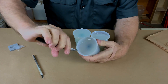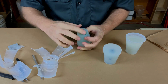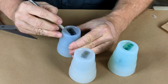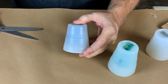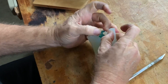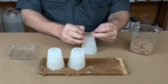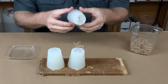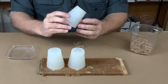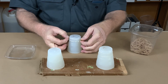Let's do some cup shucking so we can get to cutting. If I have one criticism of this Defiant rubber, it's that I don't like the color — I don't like white rubber. It's harder to cut, and it's much harder to see on camera, so I prefer rubber with a medium value color. It's also harder to close up a white mold. But this rubber is nice and firm, so it does close up well. I'm just using a single rubber band knotted and doubled, and that's all it took to close up these molds nice and tight.